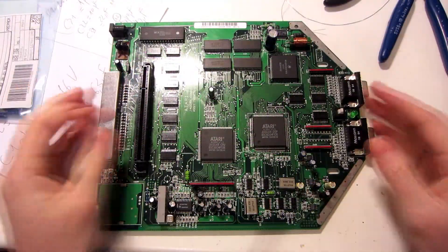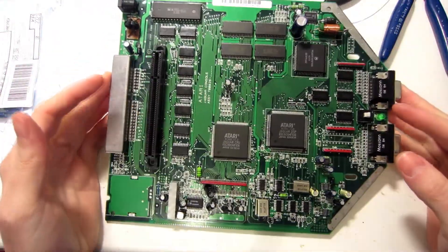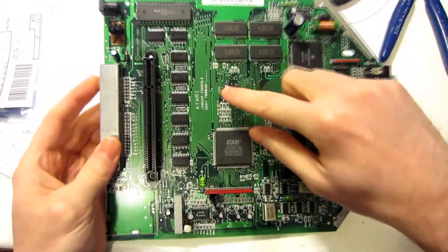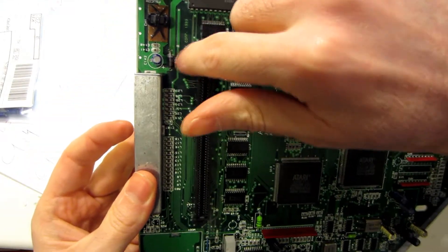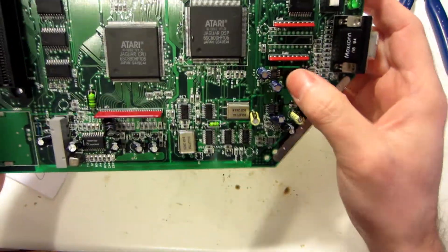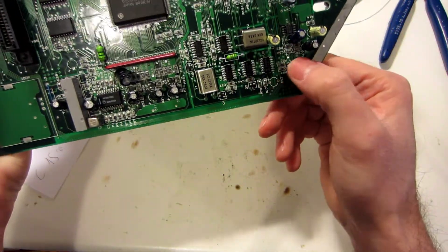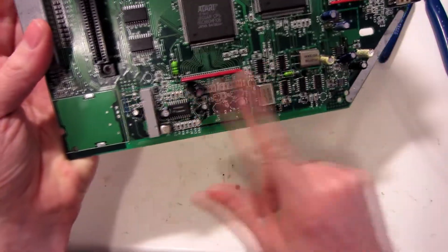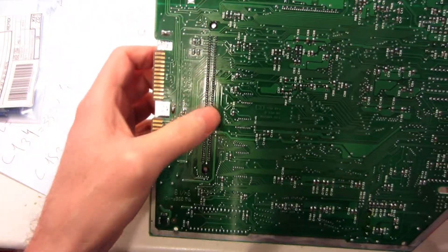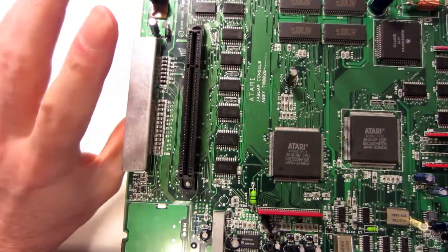So I'm in the middle of changing the caps. Nothing really noteworthy to record — only the SMD masks on some capacitors which are a pain to desolder. I've changed those two ones, this one, and this one. I've added the diode here, so now the console is protected against positive tips. I've changed the op-amp here, and I've changed those two capacitors. I already removed those ones, so I still have the remaining ones to go. I've also added some fresh solder on the cartridge pins to be sure everything is good.